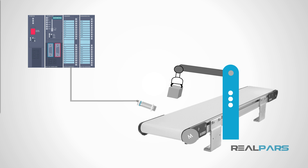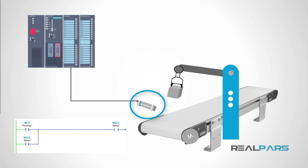DC sensors can be used to indicate the state of a device or a process to the PLC program. Knowing these input states can allow the PLC program to make decisions, such as when to start or stop a conveyor motor. In this diagram, the Programmable Logic Controller, or PLC, is running a ladder logic program. The inductive proximity switch is connected to a PLC input card, and the logic program is written to sense the state of the switch.